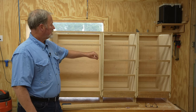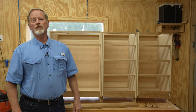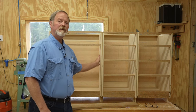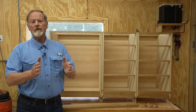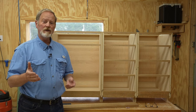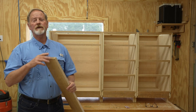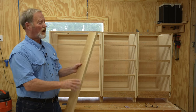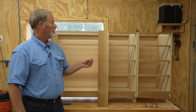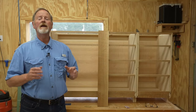The problem is that those legs are not one and a half inches thick — they're going to be proud, a little bigger. And if they're a little bigger, I cannot size drawers or doors until I know where those are going to be. Additionally, because it is wider, I'm going to have to put some shimming on the sides of these cabinets to make up the difference, to help out with the door hinges and the drawer slides. So the first step is we need to make the legs. I've got a very nice piece of quarter-sawn right here, and it's at least three quarters of an inch. I'm looking for a quarter of an inch — that's about all the reveal you would want on any piece of furniture where you're doing a mortise and tenon type construction. So we're going to take this to the bandsaw, re-saw it, take it down to two inches, try to get rid of as much sapwood as possible, and start forming up our legs.